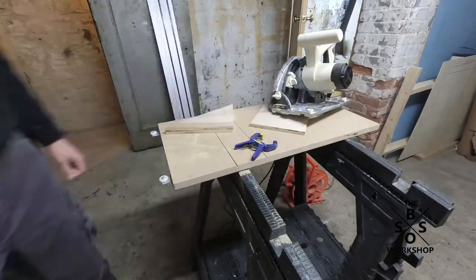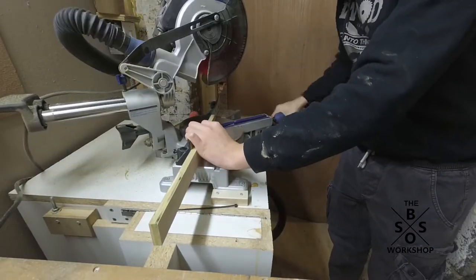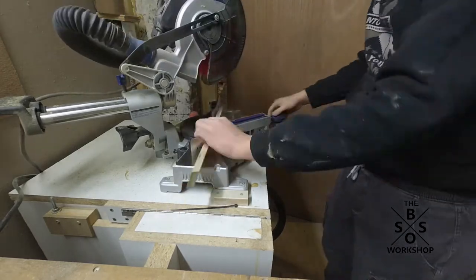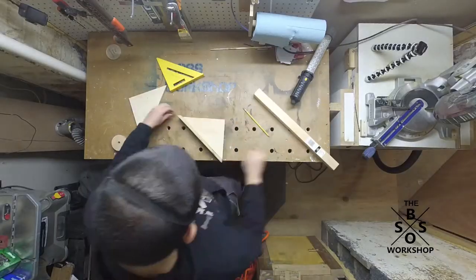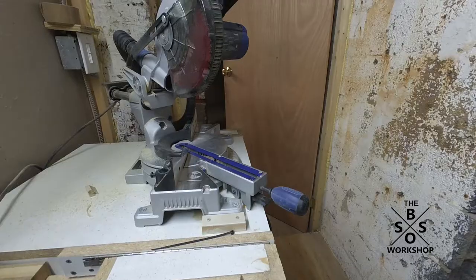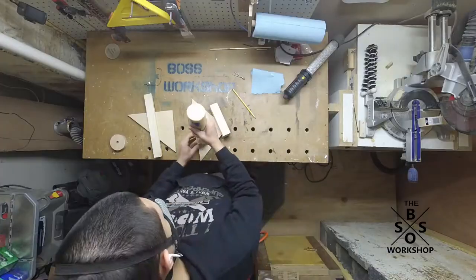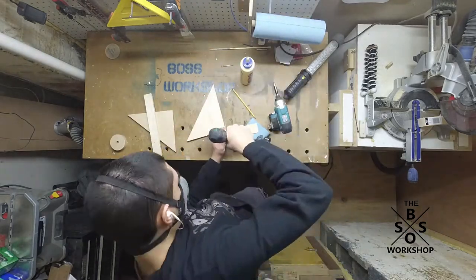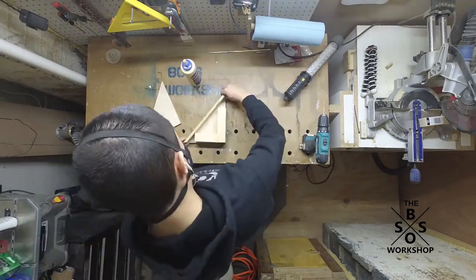After that, I got a piece of inch-and-a-half of the same plywood and cut it to 45 degrees on either end so it would fit around the corner. I test fitted to find how long I needed the 2x2 piece to be — this is what we'll be using to hold the shelf onto the wall. Once I had the lengths, I cut two pieces down at the miter saw and used glue and screw to hold those together in the corner.